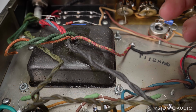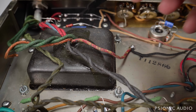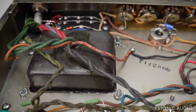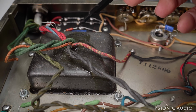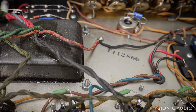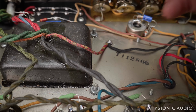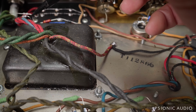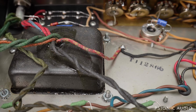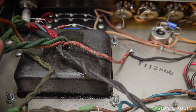You can see here in the rebuilt bias board, I've got 7 new diodes, 1N4007s. You can use ultrafast if you want. It won't make any difference in a Twin. I got a new 2-watt 470 ohm here, and a new 50 microfarad, actually 47 microfarad, 50 volt bias cap here. So all that's redone. And you can see here some 100 ohm half-watt fusible metal films, 1%, for the heater balance. And here's the old disconnected heater center tap.